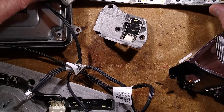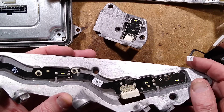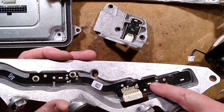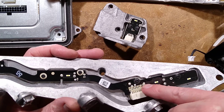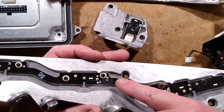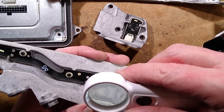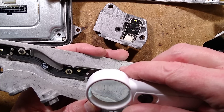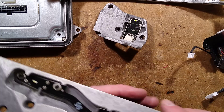Two of those sections in there will be voltage boost sections. On the main headlight section — which is surprisingly lacking in LEDs given the amount of light that comes out — there are pairs of LEDs in series, each pair taking about six volts with its own little filter network per pair. There also appears to be a zero-ohm link here — it might just be a jumper link rather than a fusible link.